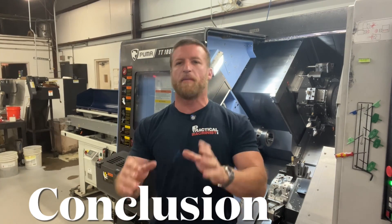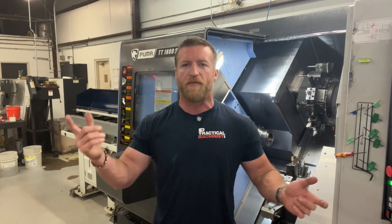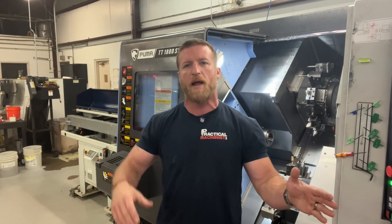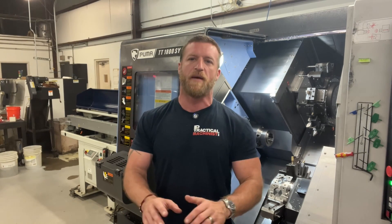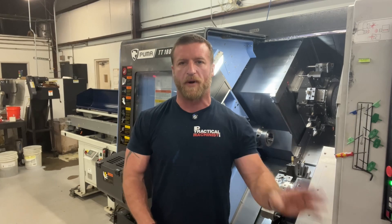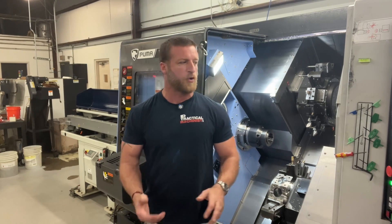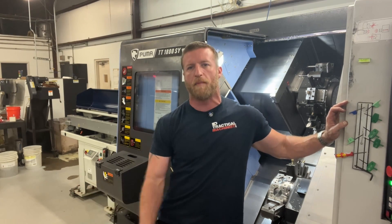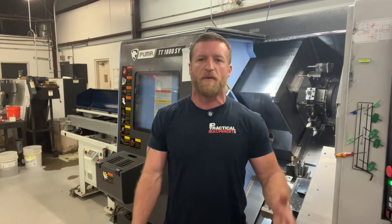Does that simulate a production environment? No, not really. I just wrote a quick program to rough off, set my RPM or surface footage, set my feed rate, depth of cut, and I slowly got more aggressive from the first cut all the way to the fourth. I added in a little slow-mo so you can take a look at the chip forming — that's my favorite thing to watch. That doesn't simulate a full eight-hour shift, but you can take it from me: I've got 20 years experience on CNC lathes. We rough with VNMGs literally all the time, every day. In fact, I'm running a job right now — 17.4 PH — using it to rough at 650 surface feet, feeding at .013, because it was sitting in the machine, touched off, and ready to go.